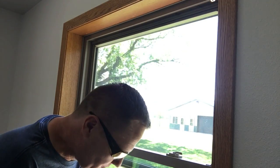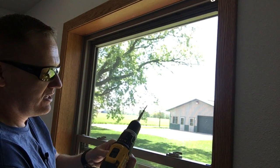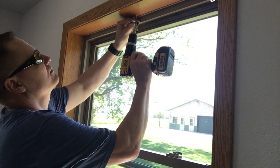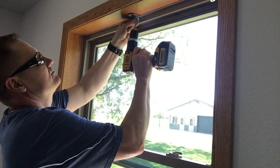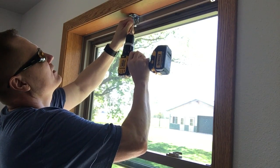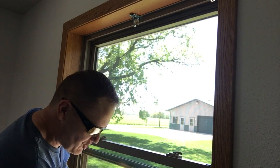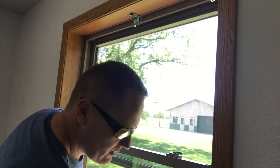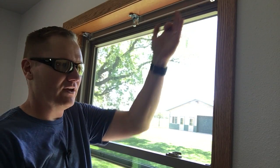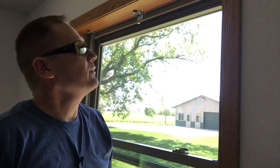With these brackets, you don't have to drive the screws all the way in until they're sucked into the wood. You basically just want them in, snug and secure so they're not going to wiggle — to the point where they're touching the metal and the wood and everything is nice and tight. If you start trying to push too hard, you're going to destroy the bends and shape of that bracket, which means the bracket won't work the way you need it to. If we weren't retrofitting and were doing it for the first time, I'd probably move these shades out about another half inch so that in the winter months, condensation wouldn't be getting into the shade.